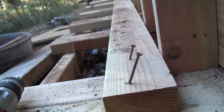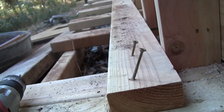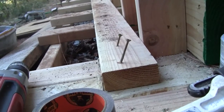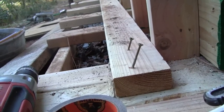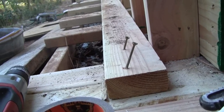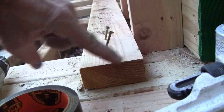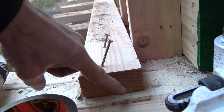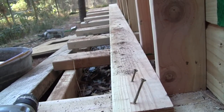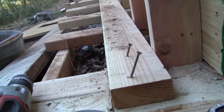It's dramatically stronger to put screws in at an angle because then you have to shear the bolts off, which takes a few thousand pounds per screw. I did a quick envelope calc on the cross-section of the steel at 60,000 psi — you can look up the actual shear strength of whatever fasteners you choose. If the screws are driven in the wrong direction, that's a recipe for them pulling out of the wood and the whole bottom kicking out, which is exactly what this design is meant to avoid.